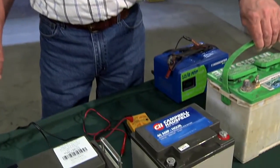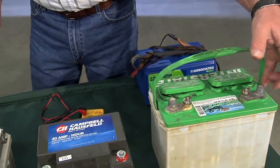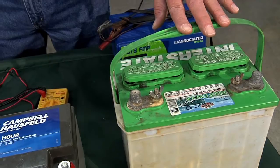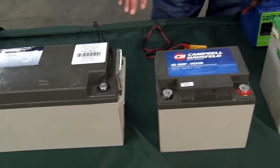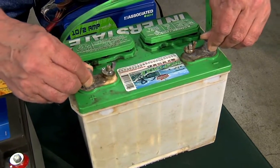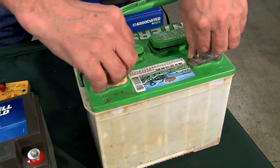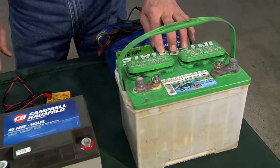The other type is a combination. Most cars and vehicles have a battery rated in cold cranking amps, which means it's designed to put out a lot of current in a short period of time to start the engine. The other type is a long-duration one, designed to put out current for a long period of time. This is a marine deep cycle battery — it has two types of outlets: standard connectors for starting the engine on a boat, and terminals to supply all the electronics on a boat. A deep cycle has both — it can start the engine and has enough capacity to run all the electronics, especially in emergency situations.